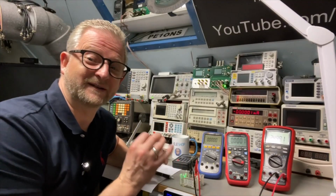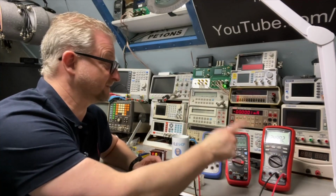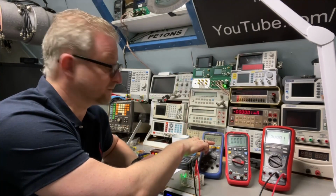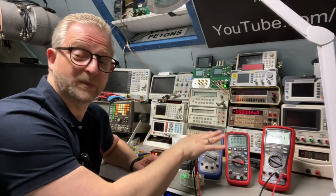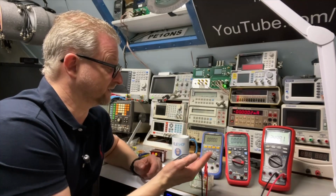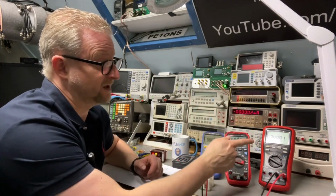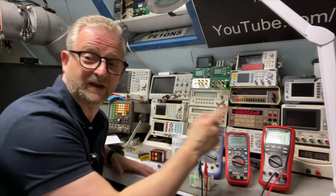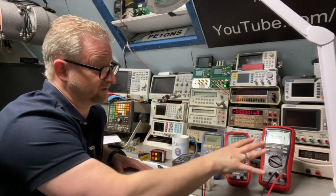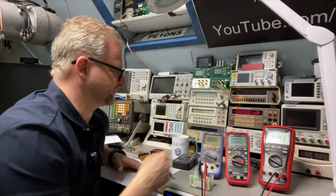I already see little differences, and it's not only because there's extra digits that you can switch on and switch off, but with these 2 meters, they have now 4 behind the point. But when I do my lowest, that is 2.5 volt, I already lose 1 digit, so then I only have 3 left. And this one both have that. But the Brymen does up to 5 volts, it will keep the 4 digits, and then I can even switch on the 5th one. So in the lower voltages, even by default, the Brymen has an extra digit, and you can even switch on an extra.